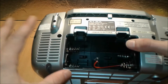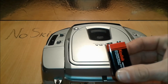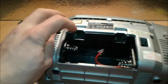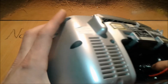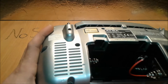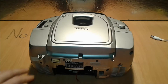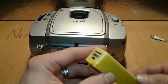For this radio I already know the polarity, but for you it's very easy — take a 9-volt battery with some alligator clips attached. Normally the opposite sides are plus and minus. There's a distinctive marking inside here, so I decided which one is the plus, attached the alligator clips, and found which is plus and minus.